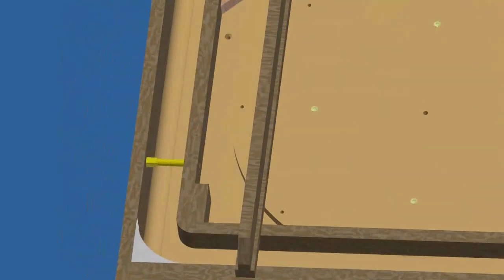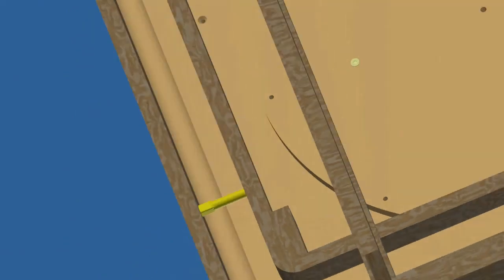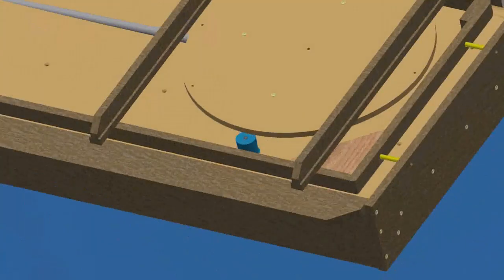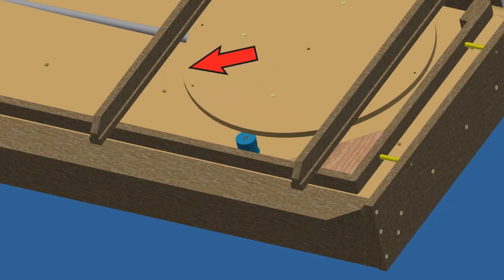Rotating around back to the top and then zooming into the lower left corner, we can see a yellow plug. There are four of these plugs and they create the channel where the bolt will go through where the legs are installed. Rotating around, we can see a blue plug. This forms the hole for the faucet, and just next to that and actually above it is a disc.